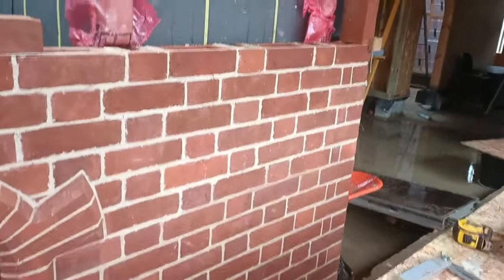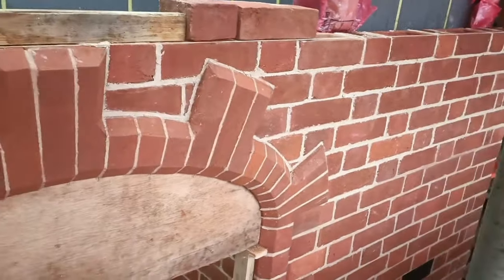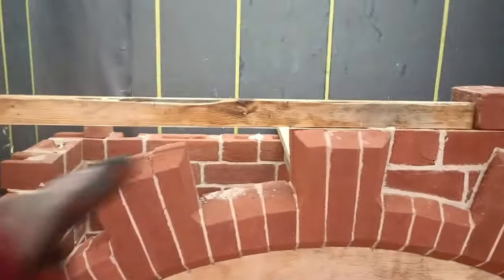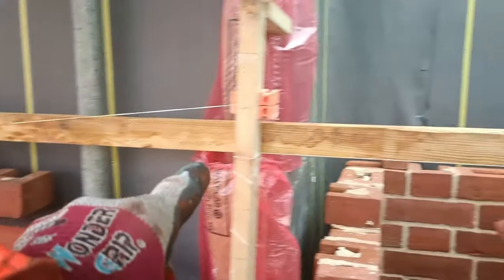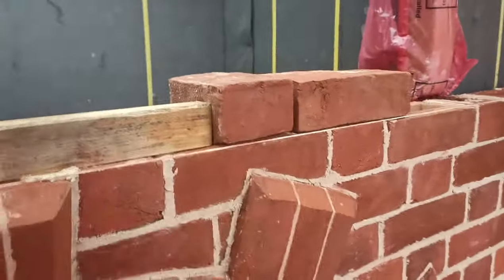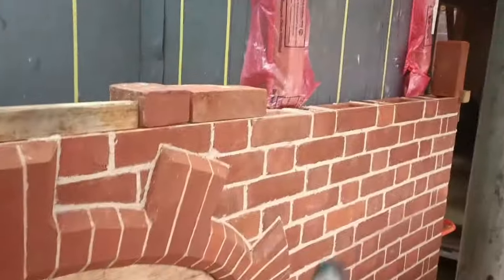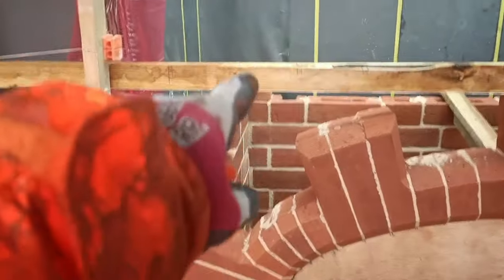On a really wet day I've just got the top ones to join up and then give them a gentle brush because everything's so wet. I've done the creepers through the right hand side and I've just put a baton across to mark all the joints that follow through from George's side - just to make sure that there's my last header and I've got a stretcher in there which all fits in. Very nice, just how we set it out originally on the bottom, so that these joints have kept plumb points there, and we've kept plumb points down here as well. Obviously we have to double check, and as I do my creepers I will then follow the joints that I've got there.